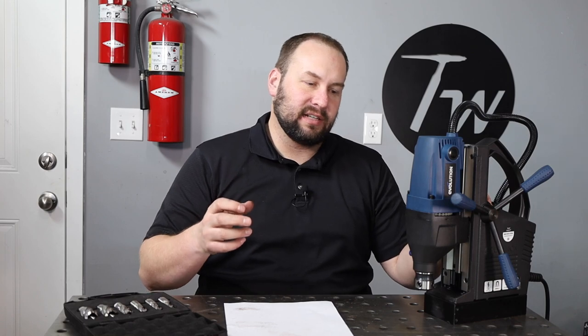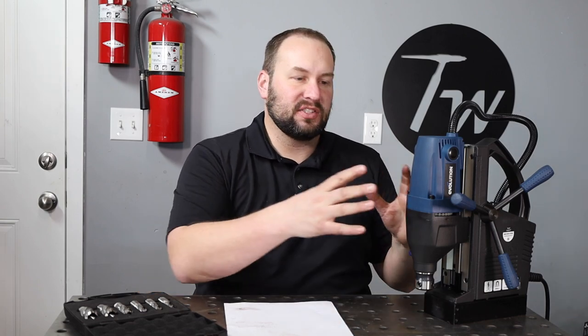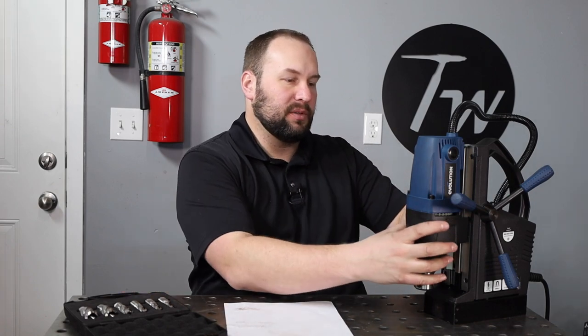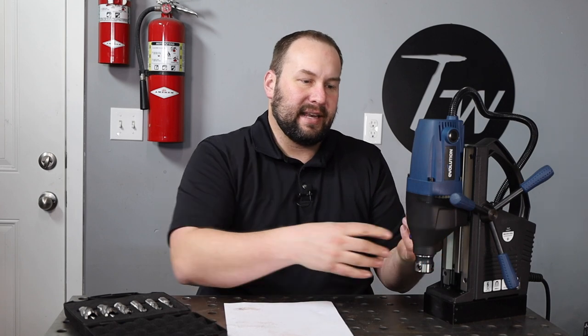So let me give you the bottom line. After trying this out both with twist drills and with annular cutters, I haven't used a wide variety of magnetic drills to tell you exactly how it stacks up, but it did the job really well. Being this smaller magnetic drill, I was concerned about power, but it has plenty of power to cut right through without a problem on this steel. I think the adjustable height is a huge advantage, being able to adjust it in two different ways. I think it'll be really useful and you'll see it on upcoming projects here on the channel.